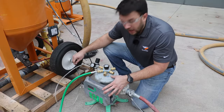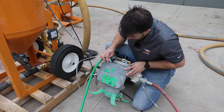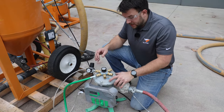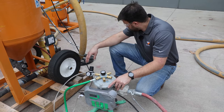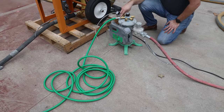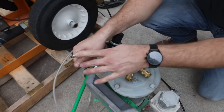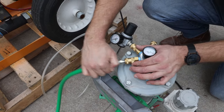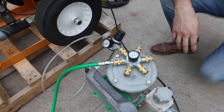The monitor is supplied by battery clips — 12 volt or 120. You turn on the monitor and it will give you a reading. Anything under 10 ppm CO is good for you. From there we go on to the breathing air line. Standard RPB fittings are different than a normal compressor fitting — they have a special fitting with a longer neck. What this does is it keeps you from putting any old air hose onto your breathing air in case there are contaminants in the line.